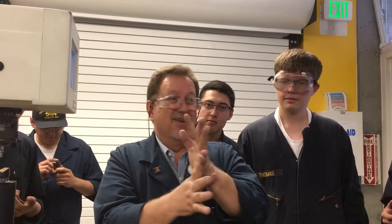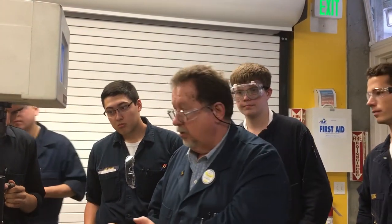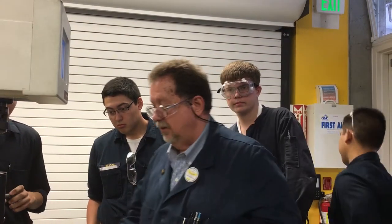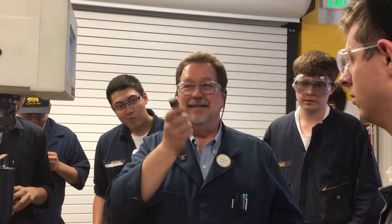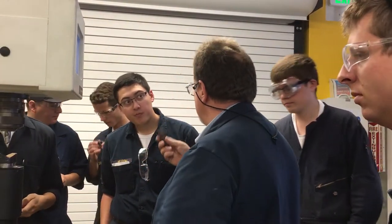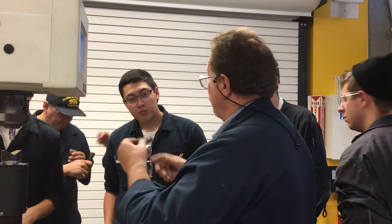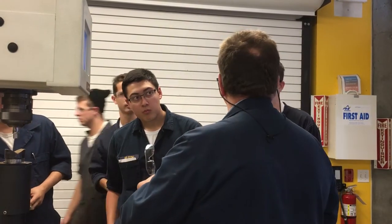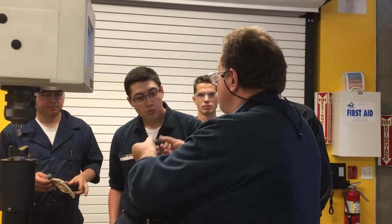So there's this interstitial lattice work that happens in that. What we're doing when we take it out of the oven and quench it is keeping it in that same state. It's more of a crystalline state, thus it's going to be harder, more brittle, less ductile. So that's how hardening happens. This happens in industry all the time. This is how gears and engine components are made out of a relatively soft material, and then heat treated to be hardened. That's the whole trick. Otherwise, I can't machine on this now. It's too hard.